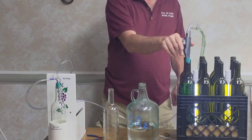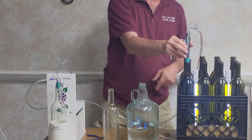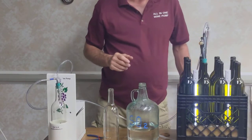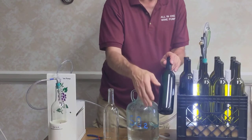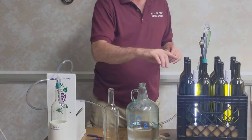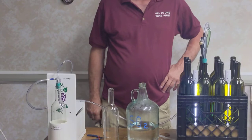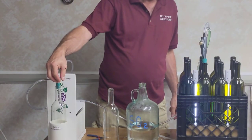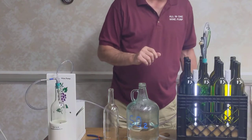It's almost going to the top. Once it gets almost to the top, we're going to push and hold, and it's going to come down automatically. Every bottle is going to be the same exact height. The nice thing about this is the bottle is clean — there is no residue, there's no dripping. Every single time, the same exact ullage, every single one going through and through. Now we have the opportunity to speed it up or slow it down. I just speed it up a little bit, as you can see, so it's going up a little bit.